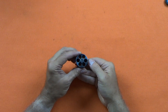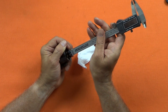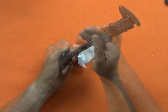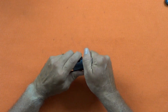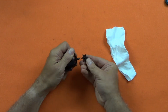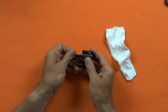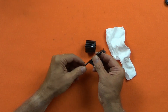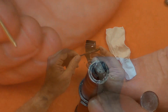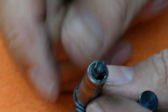The disassembly of the cylinder group begins with the ratchet. The ratchet is removed by unscrewing it. Measuring the depth of the shaft isn't absolutely necessary, but it can help during assembly. Gripping the ratchet with a rag or piece of leather makes it easier to unscrew — it has a normal right hand thread. Never use pliers or a steel tool to remove the ratchet. Now the crane and ejector rod can be removed from the cylinder. Removing the ejector rod from the crane requires a special tool. The tool engages two notches and will unscrew the crane bushing from inside the crane, releasing the ejector rod.